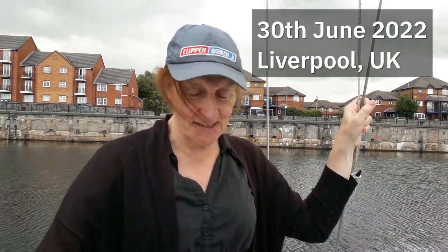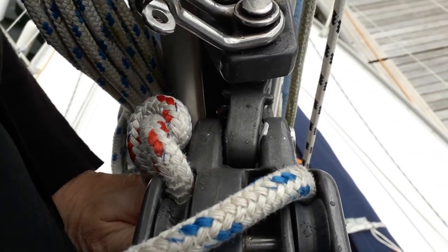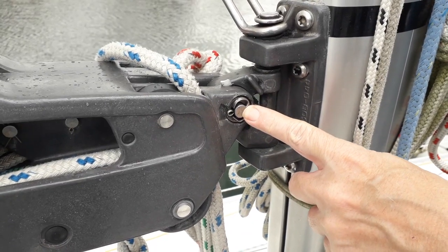The other job we've got to do is this boom — it's got some wear at the gooseneck. We've got to get a wear washer and insert it into the gap just to stop this, maybe two washers depending. So we've got to measure the size of washer we need, take the boom off, take the split pin out. It's not a massive job, not particularly complicated, it just has to be done.